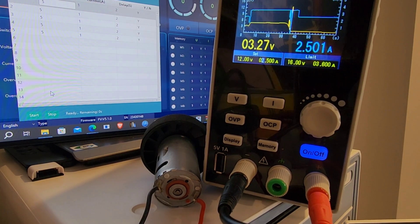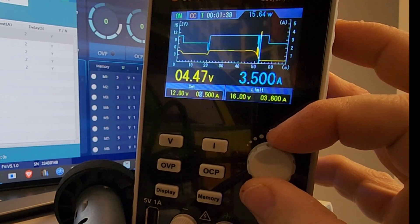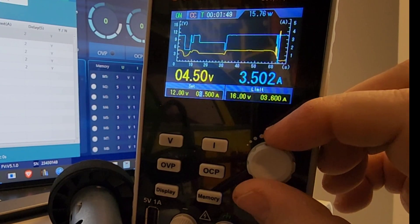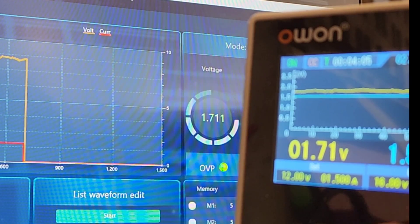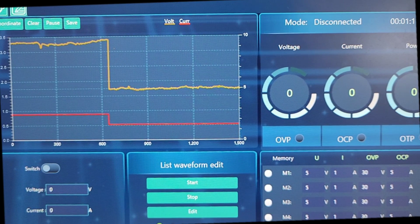I have a small DC motor right now hooked up to the power supply and you can see those waveforms being generated as we speak. The current limiter is set to 3.6 amps, protecting me from blowing that little motor. That graphical display is definitely a nice bigger display. In a nutshell, that software is pretty darn cool — the iPower control software. I have no idea why OWON doesn't talk about it in the user manual, but I will put the download links in the description below.